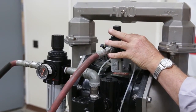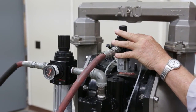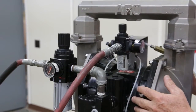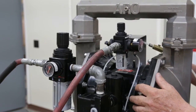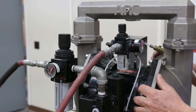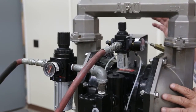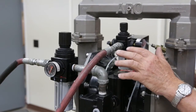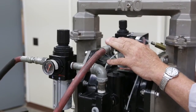If you happen to be pumping hygroscopic materials, which absorb a lot of water, you don't want to put water in the air or the powder, because it will cause clumping and eventually clog the pump or collect in the downstream side of the line. You can either supply the powder fluidization circuit with compressed air, assuming it's not going to be a problem for the powder, or you can supply an inert gas, like nitrogen, which has almost 0 moisture content and will keep the powder dry. It keeps the suspension in the pump and downstream.